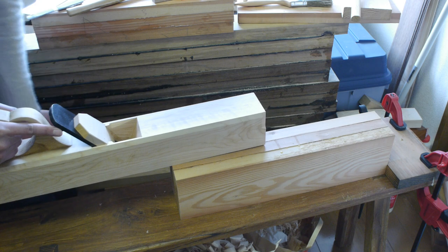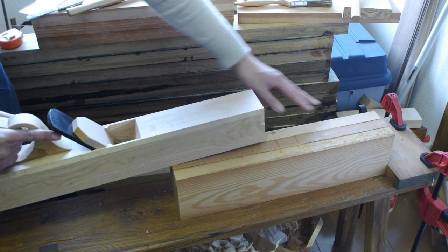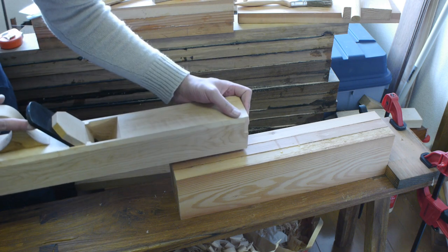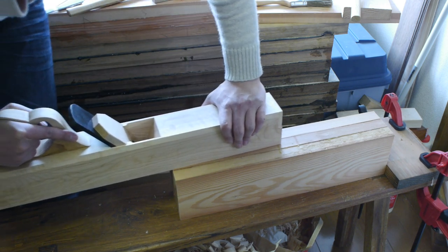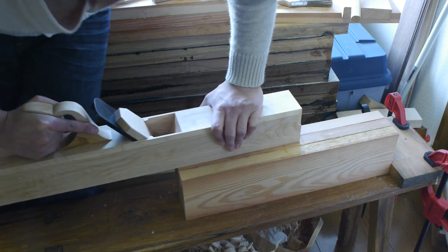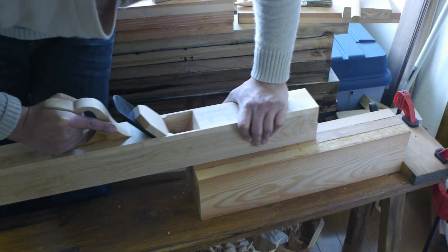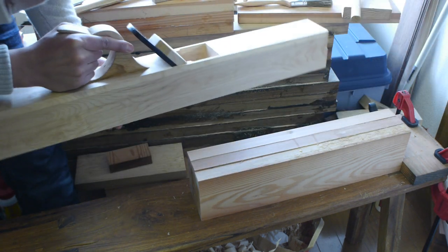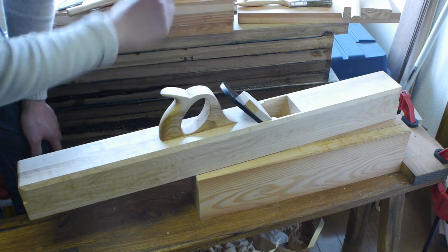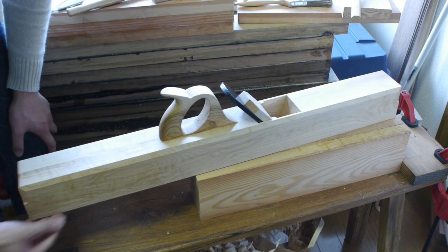Here I'm going to show it quickly in action. This is a block of laminated Doug Fir stock from the stretcher of the bench I'm making — this doesn't plane very well, it kind of splinters, but you can see it planes beautifully and the shaving flows straight out of the mouth. It works beautifully. I hope you enjoy making yours and, more importantly, I hope you enjoy using it. This has been the lamination method for a wooden, traditional-styled jointing plane.